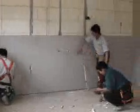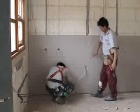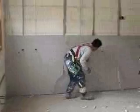Now the sheet's just simply tapped onto the wall. That squashes the corner cement into the dovetail grooves, usually about a 5mm gap behind the sheeting. So when setting up window reveals, as you can just see here, you set them up approximately 15mm inside the room, so your sheet will end up being flush when the architraves go on afterwards.